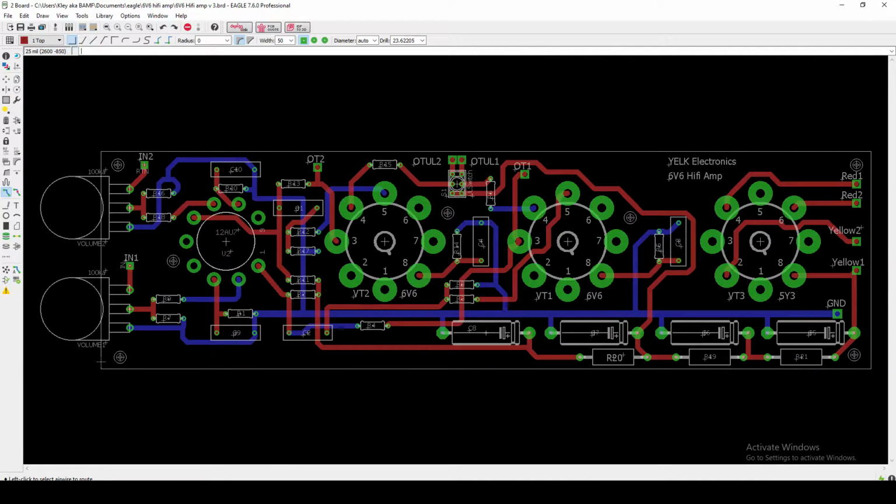And so I do believe it is going to be helpful for me to be using a little bit of a thicker trace. And really with this PCB, you can see there's a good amount of dead space. I'm not packing the components super tight to minimize space as much as possible. I'm being a little bit gratuitous because with this PCB project, I'm not sticking this in a very small enclosure, right? I'm going to be sticking it into a chassis that's going to have plenty of room. So space is not really an issue with this kind of build, but using the PCB is more of a proof of concept to see how it works for my workflow. But ultimately, I think giving yourself a little bit more room here is hopefully going to be helpful.